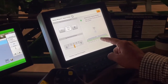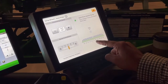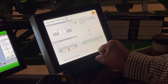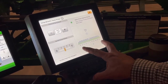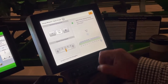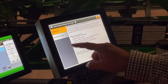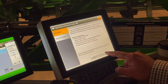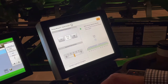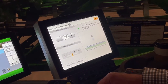The first place I'm going to get product is out of my center section. My center L1 and R1 will shut off first, and then the boom will slowly work its way down until it gets to your outer tips. So once again, auto prime and air purge — auto prime start — a surefire way of making sure your booms are charging and eliminating that V of death in your field.